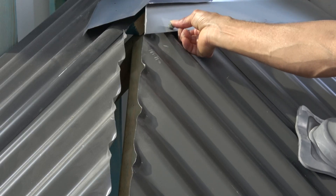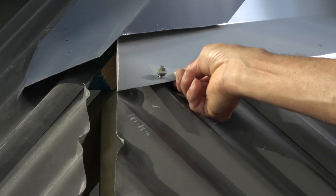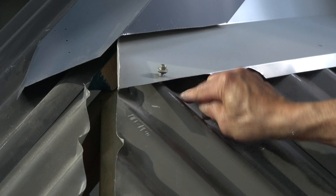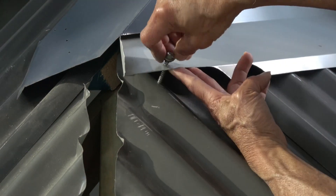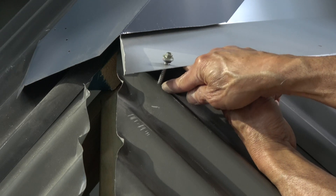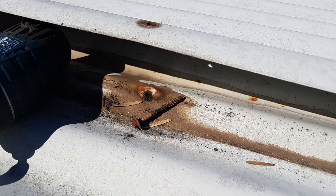You might get a little bit of corrosion around the edges of the screw hole, and that loosens it. That's all you've got — a loose screw. What will happen is that when the screw is loose, you get water that goes in between the two pieces, down through capillary action into the hole. When you get water in here, you've got threads that the water will hit.